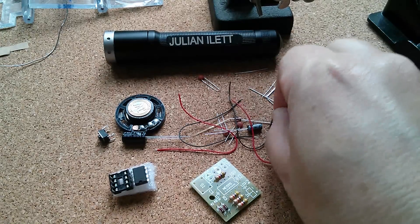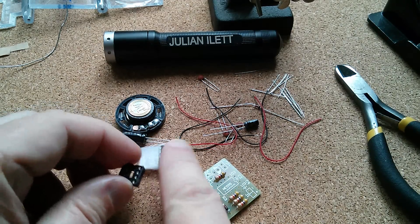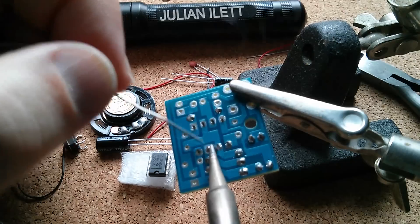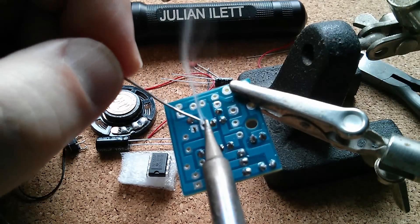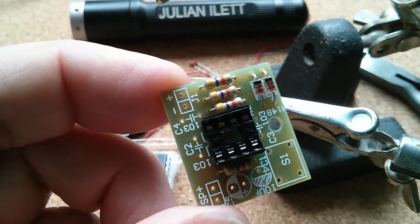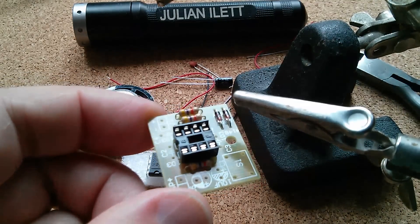What else is there that's low profile? We've been given a spare diode - that's pretty good in a 50p kit. I suppose the chip is the next one. Shall I bother using the socket? Since the socket's been supplied, I'll put it in. That seems to be holding itself in reasonably well, so I've not needed to resort to blue tack. I had to align the index pin with the mark on the board so that pin 1 - also marked with a square pad - is in the right place. There's the little notch on the silkscreen and a little notch in the actual socket, so I've aligned those. I don't need to push the chip in just yet.